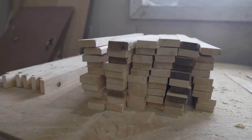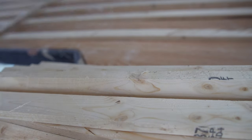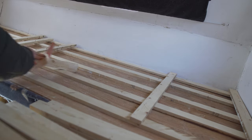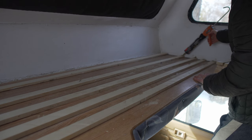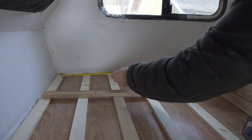So these are all the boards and now it's assembly time. For my main piece I have five long boards and a bunch of short boards that are cut to the length they need to be for the entire width. Then I place the longer boards with an equal spacing between them — in this case it was four and a half inches — and I've dotted the ends with some construction adhesive.